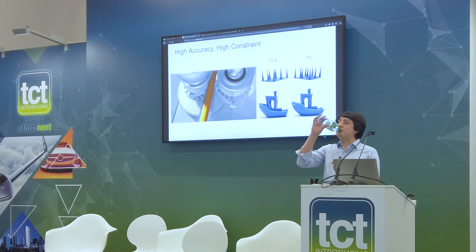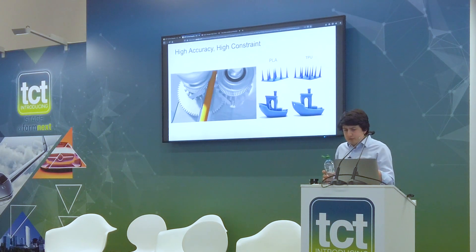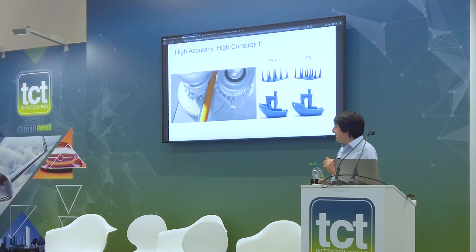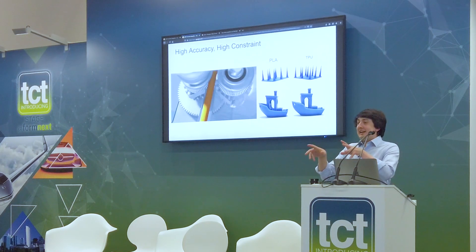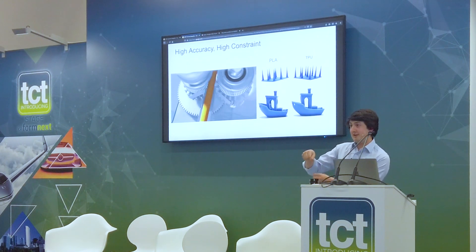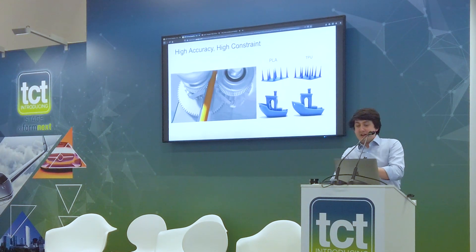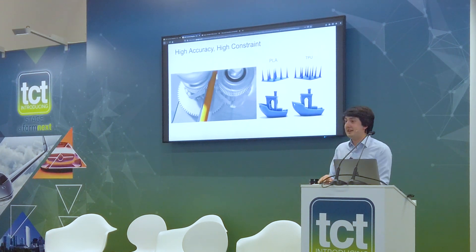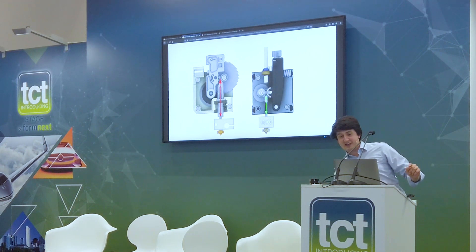Driving on both sides is what you can see here. The bit that's really hard to demonstrate on screen — but if you come and see it in person — is that where you're driving the filament and where it gets melted is about 10 to 15 millimeters apart. That means if you've got squishy material, there's only 10 to 15 millimeters of it you can push on really hard without it flexing. If you look at the PLA and the TPU print, they're done with the same settings, yet you still get incredible retraction — that's the difference in drive distance between teeth and melt zone.